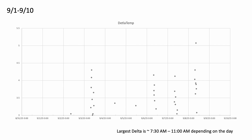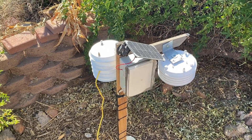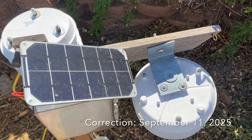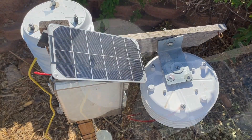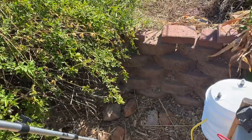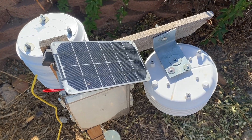So what's going on during that time of day that's causing that bias? It's about 9:20 a.m. on September 10th, and you can see here that one of my radiation shields is in the shade while the other one is in direct sunlight. I visited this a little bit earlier today and this one was even more in the shade. I'm trying to get a time lapse to actually see how the shade casts across this, but that probably explains why I'm getting a temperature difference in the morning between these two radiation shields.